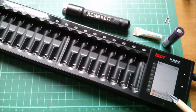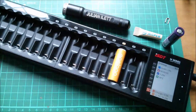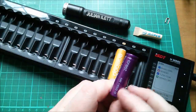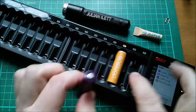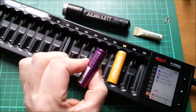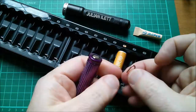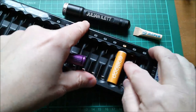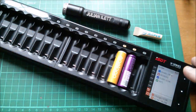I've set it to do a half-amp charge with auto battery type detection. Putting in an Eneloop as the first cell — it detects that as nickel metal hydride. Now putting in this lithium ion 14500 IMR EFEST flat-top cell — it doesn't detect that at all, because the flat top simply doesn't connect with the deeply recessed positive terminal. That's a bit of an issue, but relatively easily solved. I made up this little loop of wire — I'll just drop that down in there — and it works absolutely fine: it detects it as a lithium ion at 4.17 volts, which is reasonably fully charged.